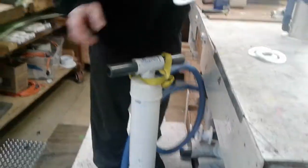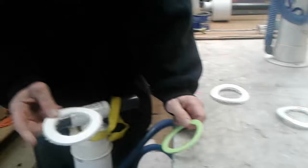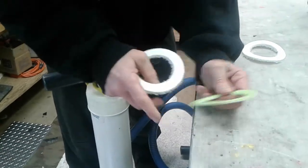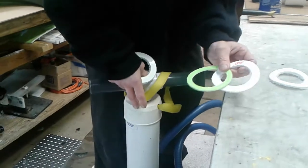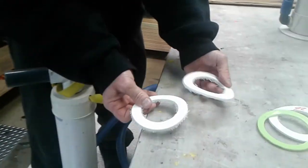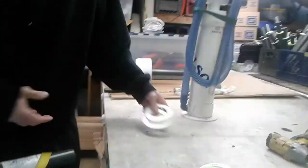On the inside there should be one of two kinds: there will either be a fuzzy four inch or a very smooth four inch. It may also come in white with a '26' written on it. The ones with the '26' are SDR 26s. The ones without the '26' — the nice fuzzy ring — those are SDR 35s. Those are our standard.